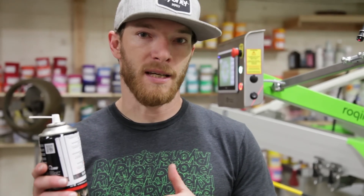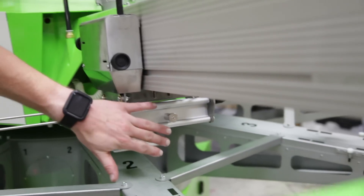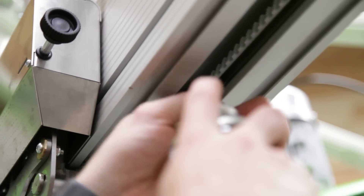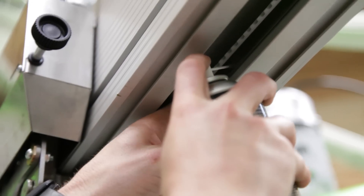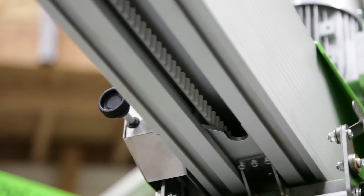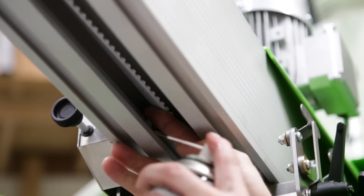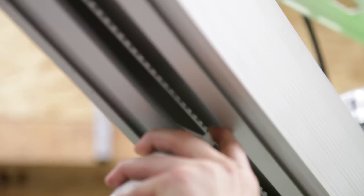Now I'm going to grab my can of VDM18 that came with the press and I'm going to lube my aluminum profile that the print carriage slides on. Make sure that your print carriage is in the full back position. Using your finger, go ahead and pry the belt back and spray the lube over the outside of the round side all the way down the profile. Going to the other side of the print arm, pull the belt back and spray in the notch of the square side all the way down the print arm.